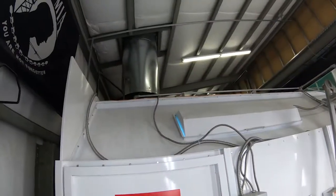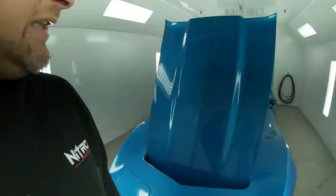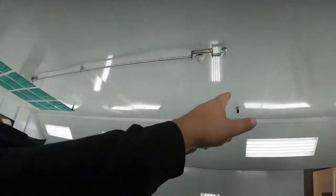Now behind my spray booth, I have that second PCI 17 bottle back here. Now that bottle is the one that feeds the exhaust fan alone. Now feeds one above and one below the fan. You can see all our LED lighting's lit. Very bright. Lighting is well placed. And very impressed with the lighting, it's perfect. You can see the 4 nozzles, 2, 3, and 4. They got covers on them right now. Now those covers just keep debris out in the meantime. Now when the system gets set off, those will actually pop off.